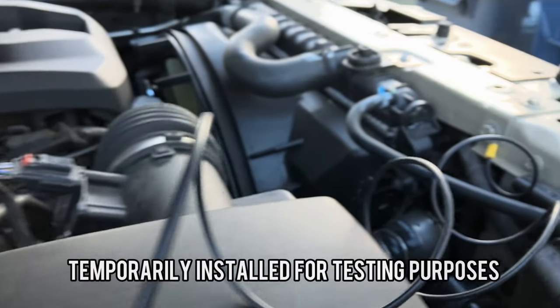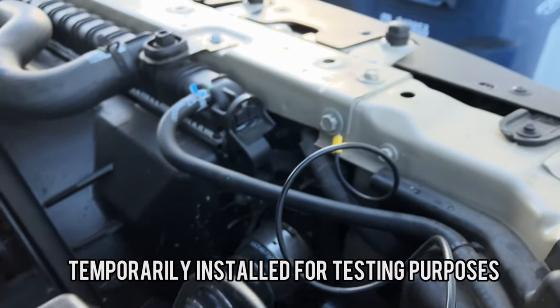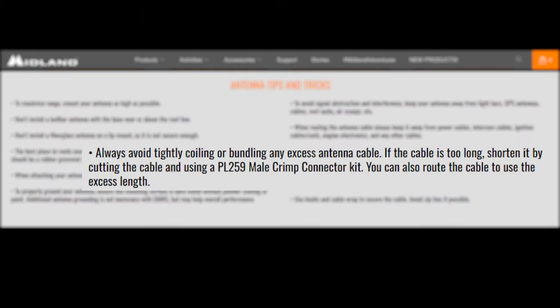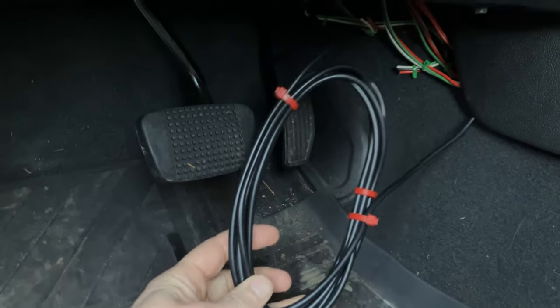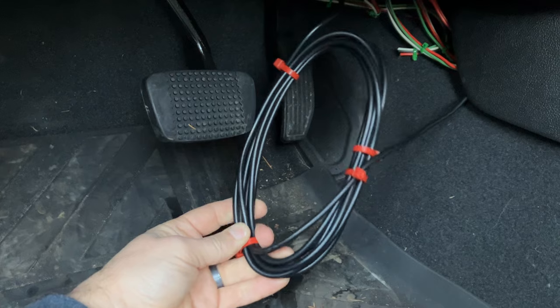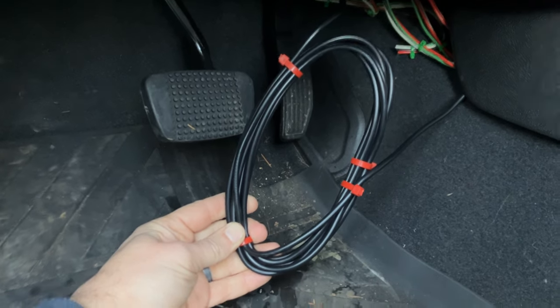Since the Midland website says that adding an electrical ground may be helpful, we're going to add a ground strap to the antenna that ties into the truck body. There's another tip that says always avoid tightly coiling or bundling any excess antenna cable. I remember from when I installed a CB radio in a previous vehicle that you're not supposed to coil the excess coax cable — I did it anyway when I installed this radio, thinking I'd go back and fix it later, and clearly I didn't.